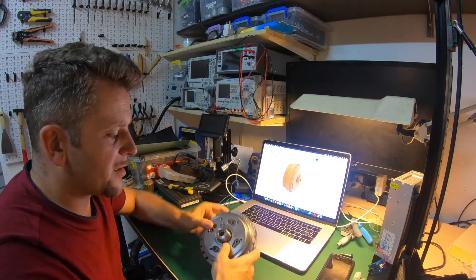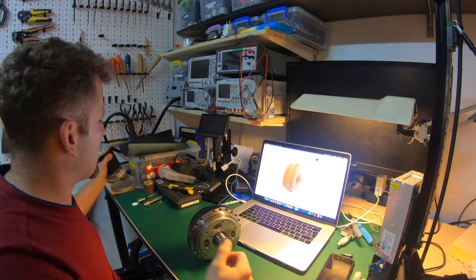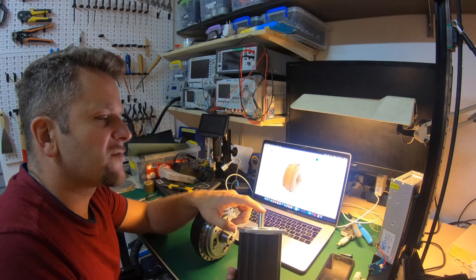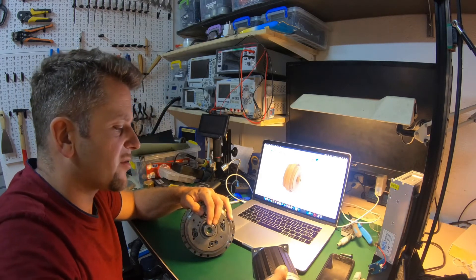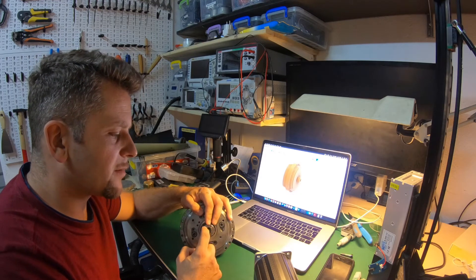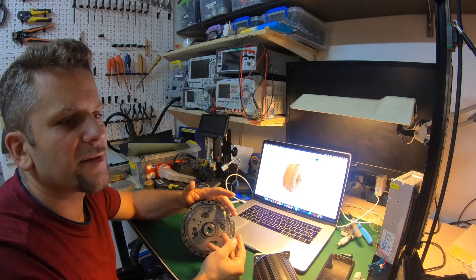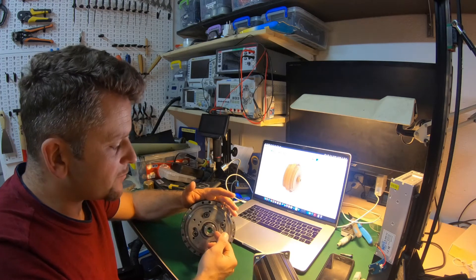The problem was how to drive this. I will spin this with a ClearPath motor that I got last time when I was in the US — it's a NEMA 34 size motor. Initially I thought I'd couple them directly, but the shaft of the NEMA 34 motor is 12.7 millimeters, which is half an inch, while the inside of this bore is only 12.4 millimeters. So initially I thought I'd wire EDM cut this to 12.7 millimeters and cut a keyway in it, but that was quite difficult because I couldn't find a way to seal it so that the water and metal particles being removed wouldn't get inside.